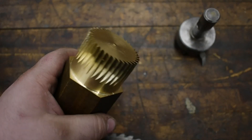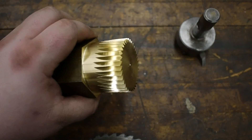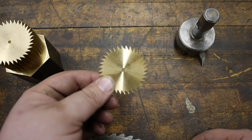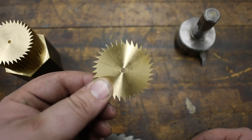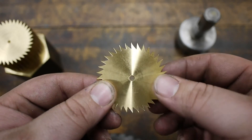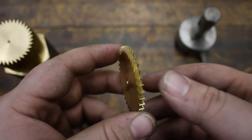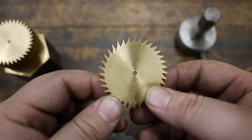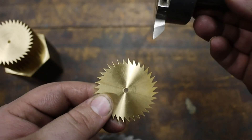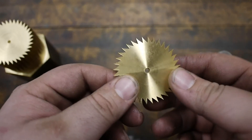We made a pretty large slug, so we can make a couple just in case of any errors or if we need a replacement. I went ahead and chucked it up in the lathe and parted off one escapement, which is an eighth of an inch thick. The finished pattern on those teeth is really crisp and sharp — it's a perfectly machined escapement. There's an eighth-inch reamed hole in the center, and the escapement should be absolutely perfect for the pallet fork. It's amazing that using a hand-ground cutter with an indexing head you can produce just about anything.